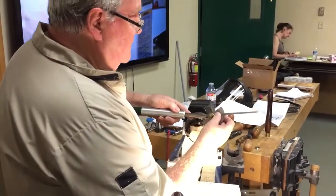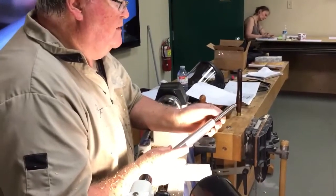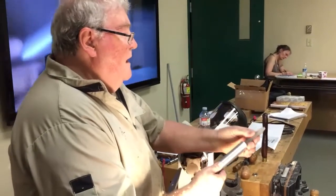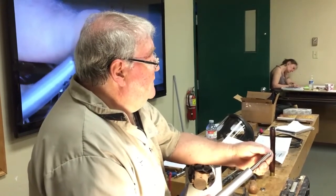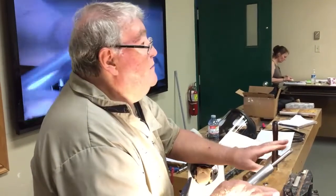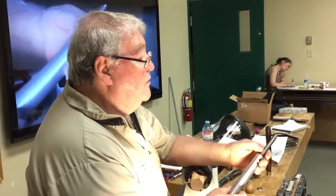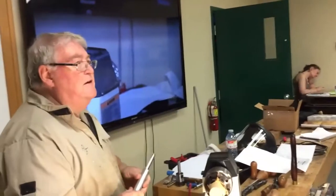We took our trusty little protractor and we could get it on there, on the edge here. If you think of a bowl gouge like a scraper is flat, right? And if you were to curl that scraper up, you have a bowl gouge. And another fellow I'll mention in a minute is Myron Curtis, he was the first one I heard say, if you think of it, a scraper is nothing more than a bowl gouge flattened down. It's the same as a bowl gouge. So if you took a scraper and you sharpened it to 30 or 40 degrees, as he says, and then you curled it up, that's what you have, 40 degrees in all directions. So what did the wood see? 40 degrees. 40, 37, not much in it.